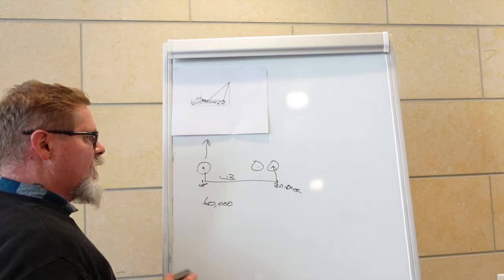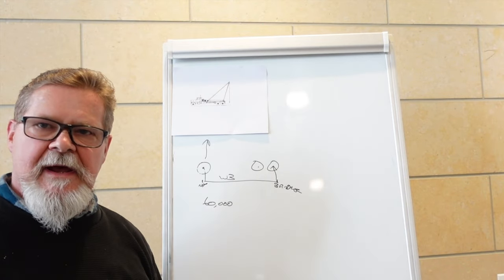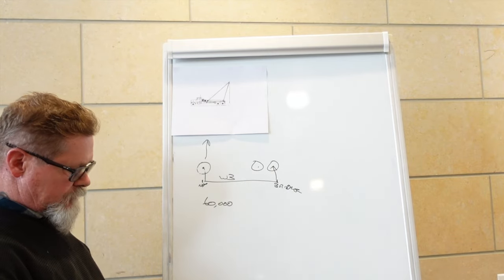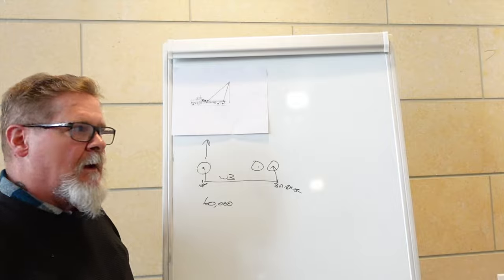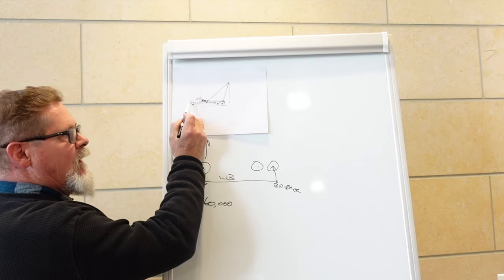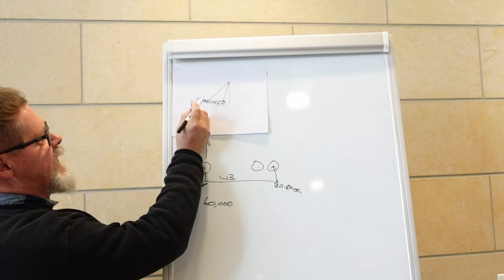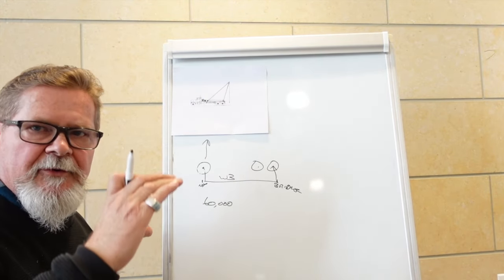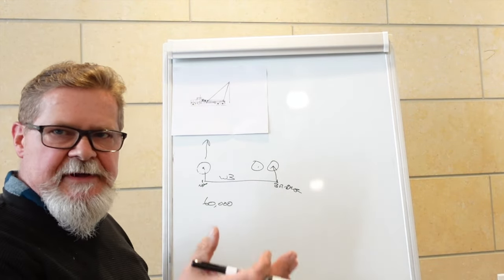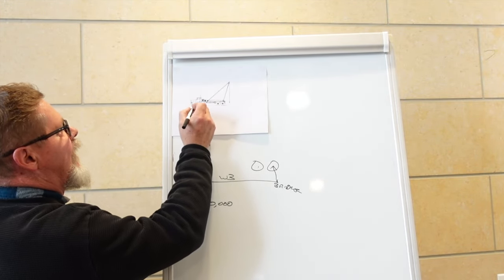Okay, this is the part where things are gonna get terrible. Remember wheelbase. Remember, again, these trucks can be as long as an average semi-trailer of 40 feet. They will pick up a lot of stuff. And their hoisting capacity is directly proportional to how much weight you have up here, because this is like a teeter-totter. The big heavy motor, all of the big headache rack, you're talking about tube steel, it's 4 inches thick up here. And you can literally lay these trucks over on their side and only break off the mirror. They are built tough.